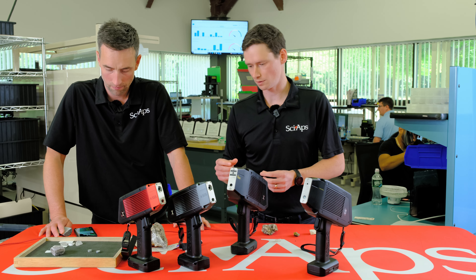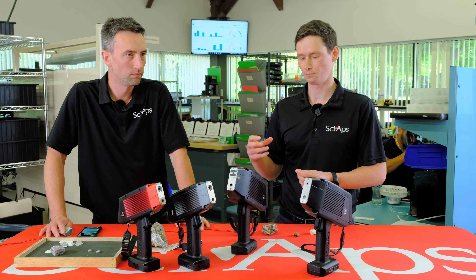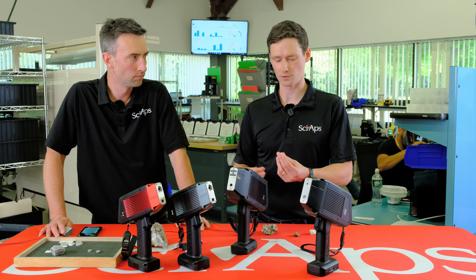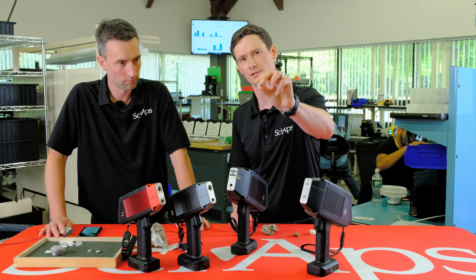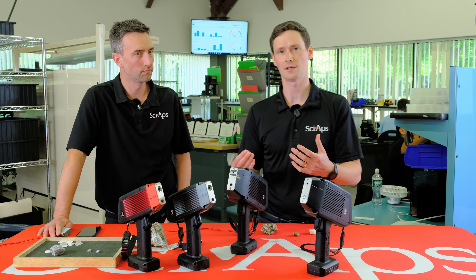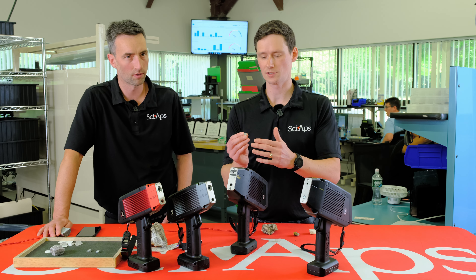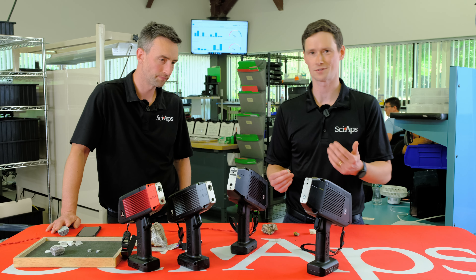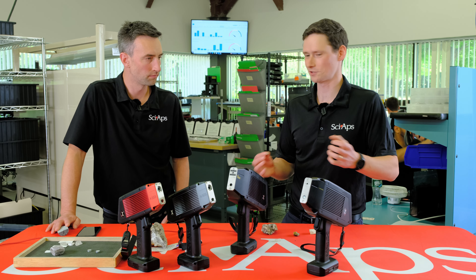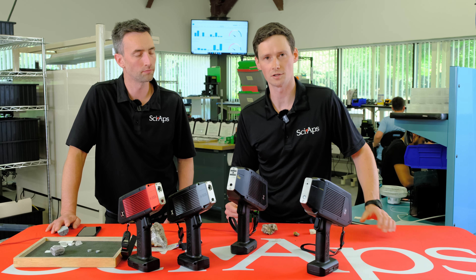If you're looking at a rock like that, you would crush it up, pulverize it, homogenize it. And then, once you've got that fine pulp, you can press it into a little pressed pellet just like this. This will give us a repeatable analysis — we can shoot anywhere on this pellet and get the same result because it's all homogenized. It's nice that we press it down because we give a firm, solid surface for the laser to interact with. If you tried to just shoot a powder, it'd just go poof and you're left with a big crater — you're not going to get a good test that way.